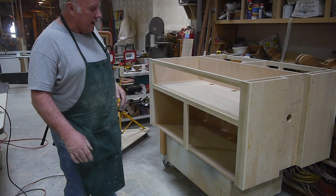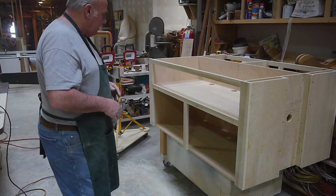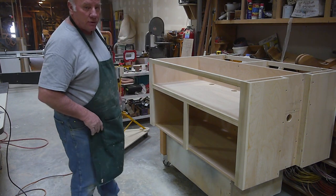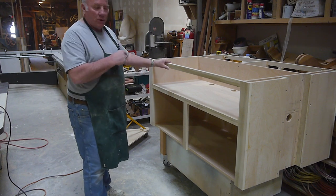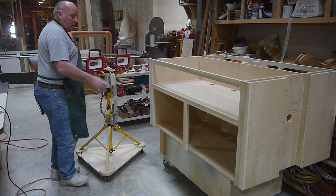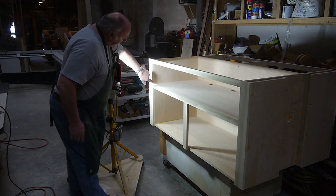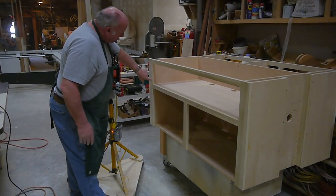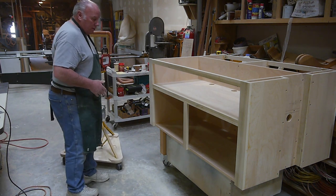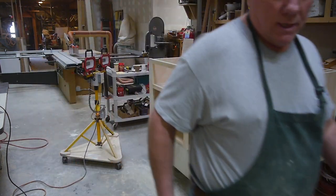That's my new LED light. Normally I use it while I'm actually sanding. You can see when I turn it on it messes up the video, so I'll sand and then just double check. Everything looks good here if I just look at it, but if I put the light on I can see I'm not quite flush yet - I can't feel it but I can see it with the light. So this is why you really need the light to work with.